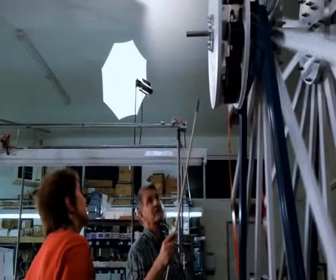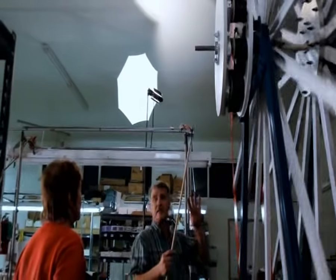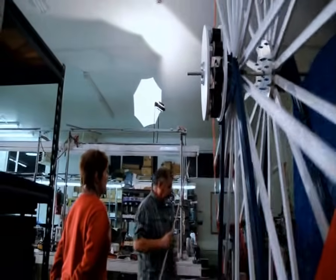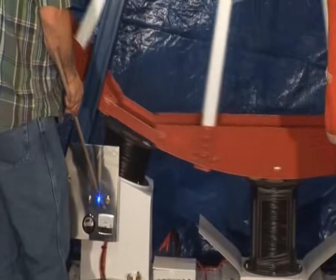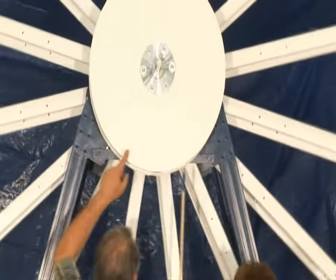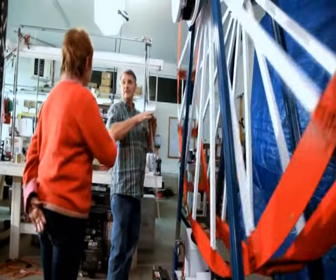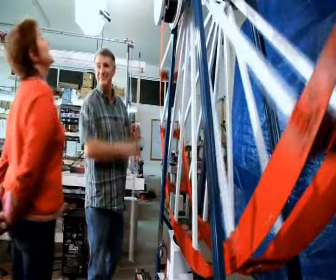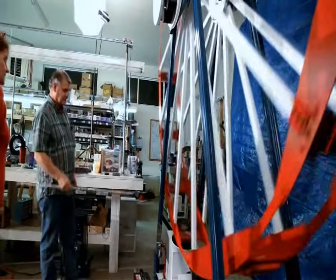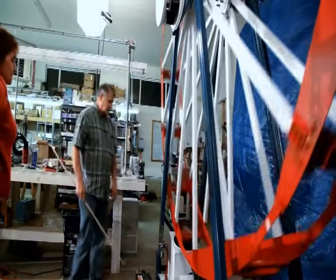And when it's in this condition, 5 of them, it can only fire 5 little spikes as it turns around, and each one of those little spikes is firing there. So what happens to the other one each time? It becomes the opposite pole, and when the magnet flips, it attracts it in. Okay, so next thing is the switches.